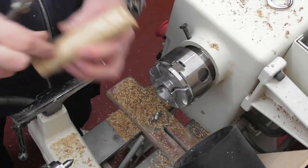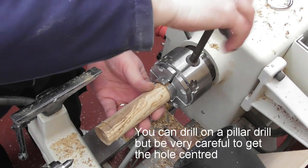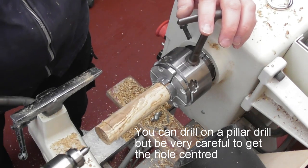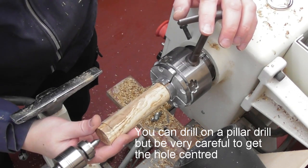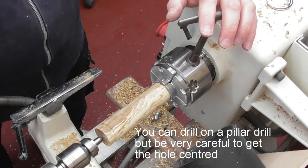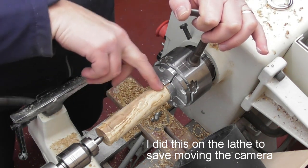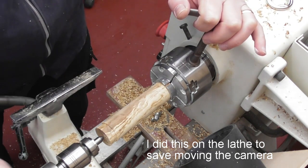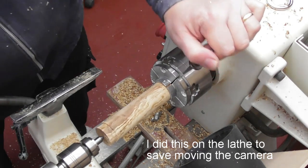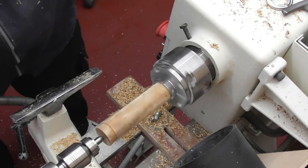Little dovetails at these ends, and I'm going to pop that in one end and just loosely tighten it at this point. I'm going to bring up my tailstock and make sure that it's aligned in the center so we're still central to that. I'm just pushing that little dovetail right up to the end of that chuck to get it nice and secure and level. The tighter we have it the better. We'll tighten that off and just double check by spinning it by hand that we are pretty much in the middle.